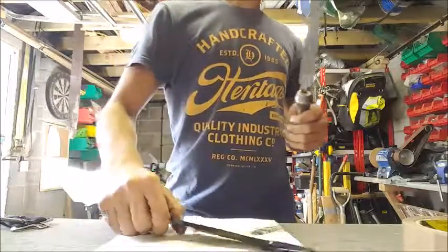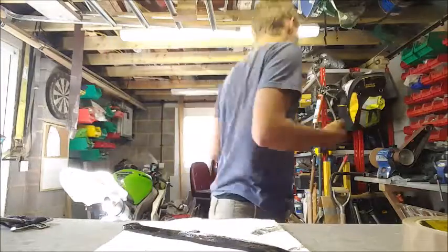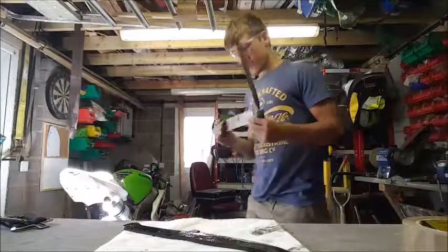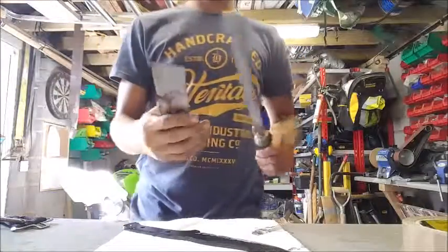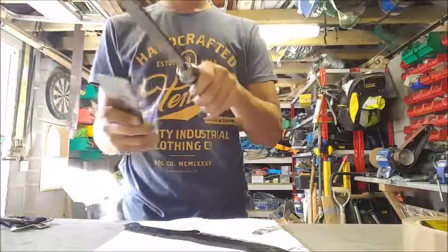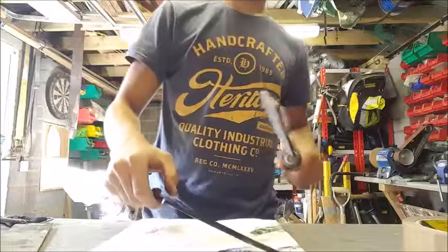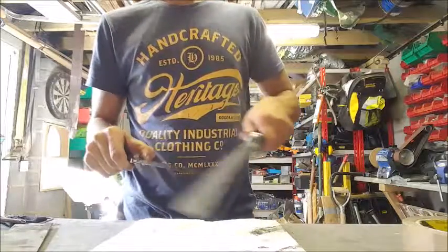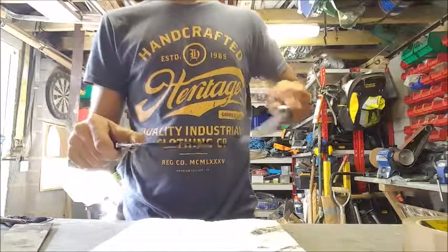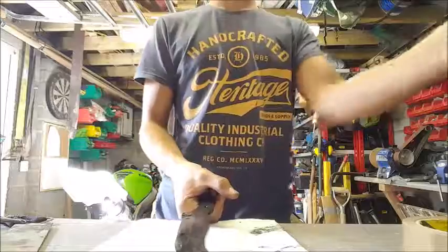Listen to that, good solid sound compared to if I can find any other bits of metal around here. This is just a normal bit of mild steel. The other sound. Hear how it kind of bites in. Whereas with this one, it's a definite skating action, which is really good because I didn't want to have to heat treat this more